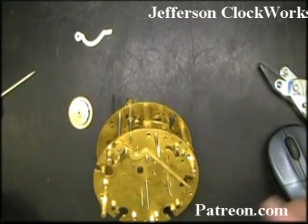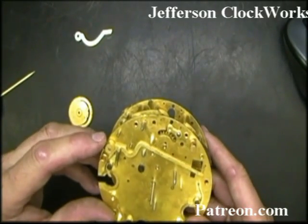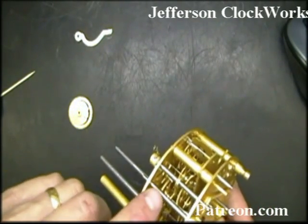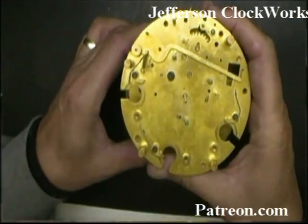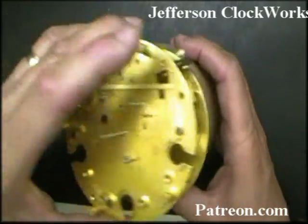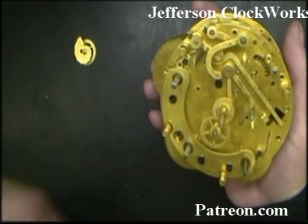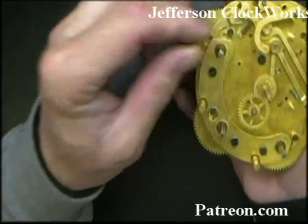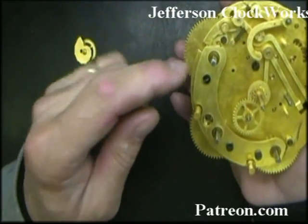We're now in the beginning stages of putting it back together. The gears are all in there, but as far as the levers go, they're a strange burden themselves. This arbor here that had nothing connected to it — now's the time to connect up this lever, which runs closest to the front plate. It's the next day, and I went ahead and popped in the mainsprings. Each one of the mainspring arbors, the barrels, caps, and springs are all unique to their function, so make sure you don't mix them up.